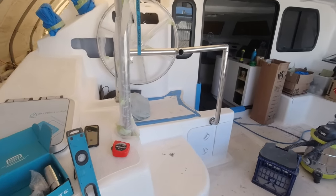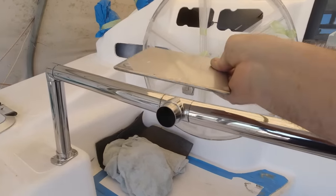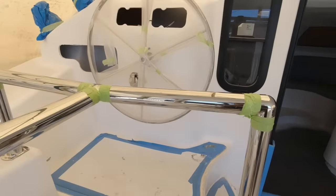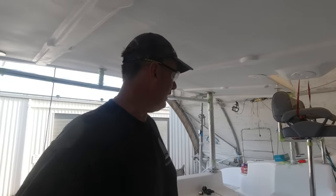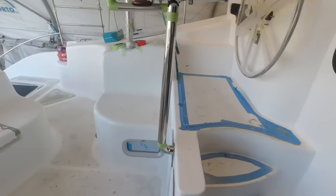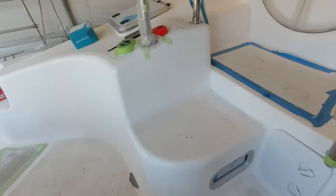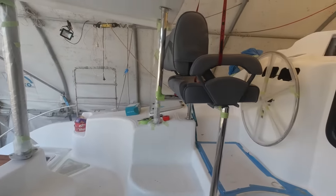These have been sitting here for about a week. That weighs about 25 kilos. It's a good quality 316 stainless frame, looking pretty flash. Where the sliders mount, I'll weld a plate onto the top with a gusset so I can bolt the seat to the plate. I'm happy with the design, especially if I can get a footstep on the bottom. The one thing that's really irking me is that I've lost this seat here - you can still sit there but you'll hit your head. That's going to have to be straightened up because I still need to drop the roof down about 50 millimeters, so that's just a temporary replacement.